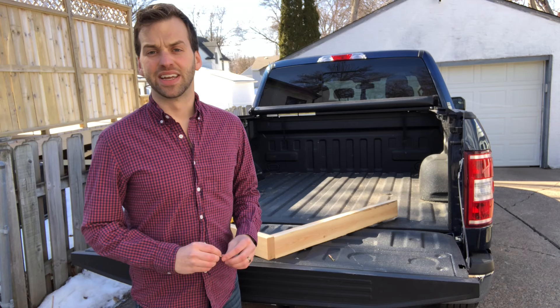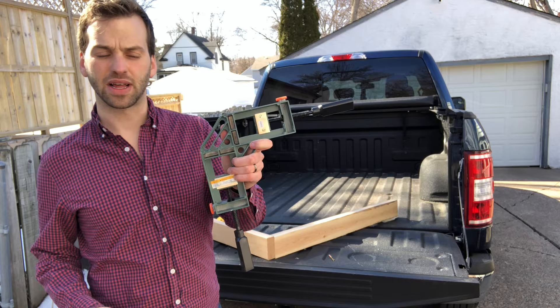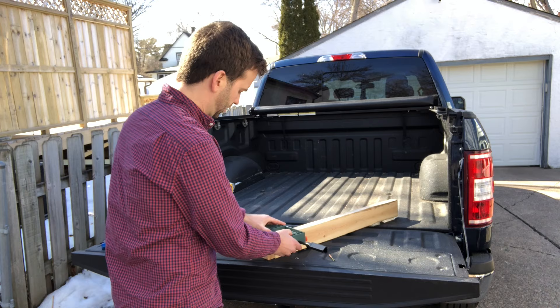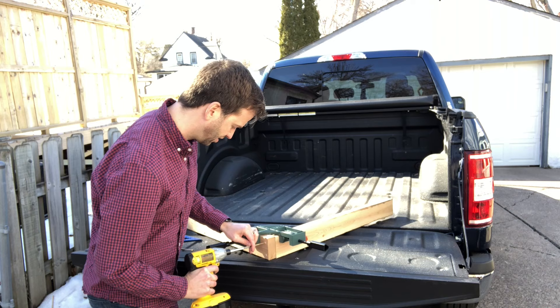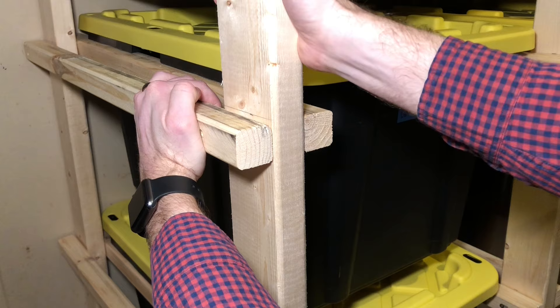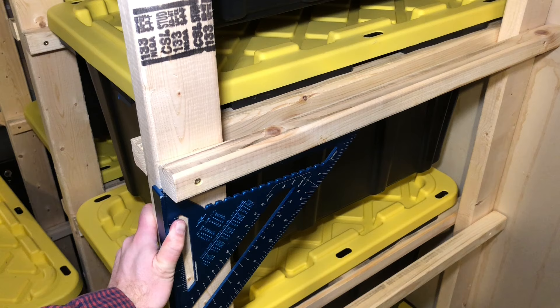For construction, I like to use 2 and 3 quarter inch T25 Torx head screws. If you're going to do any type of construction work, I highly recommend a 90 degree angle clamp specifically made to hold 2x4s at a perfect 90 degree angle — I'll link to one below in the description. A SpeedSquare works just as well. When you're mounting your rails to your vertical supports, be sure to stagger your screws, because you're screwing in both sides of the 2x4 and you don't want them to hit in the middle. I also like to use a SpeedSquare to make sure that my rails are perfectly level.